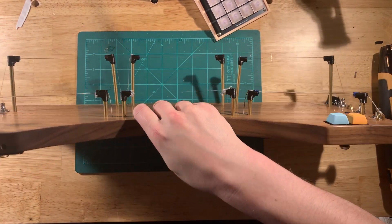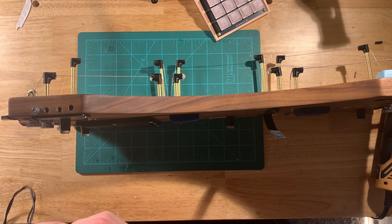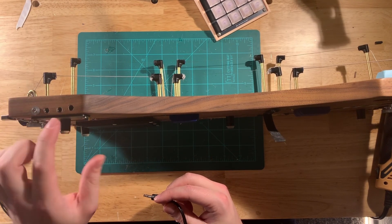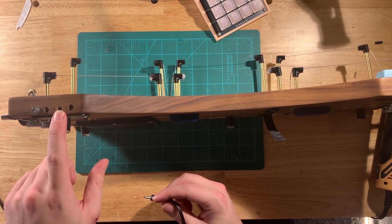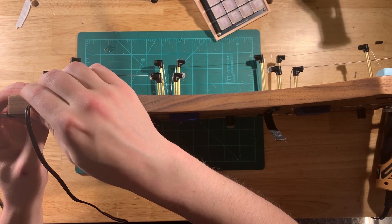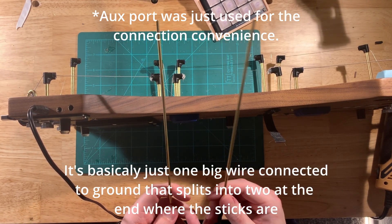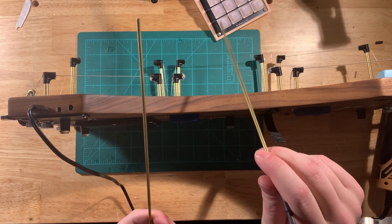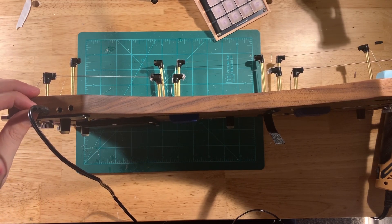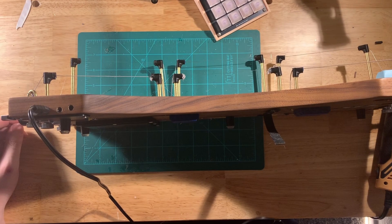So I'll take a look at the front. There are a couple of ports here. At least one of them is just a mistake and doesn't do anything — this one's just a hole. One of these goes to a foot pedal, which can be used to trigger a kick drum. And then the other one is just an aux port — I'll go ahead and plug that in. This is connected to ground on the Raspberry Pi Pico, so these brass rods have ground, and when you hit the strings it just completes a circuit. This little metal thing is just an extra thing connected to ground, basically just in case I wanted to mess around with adding other accessories, but I haven't at this point.